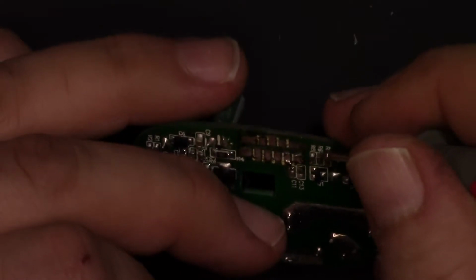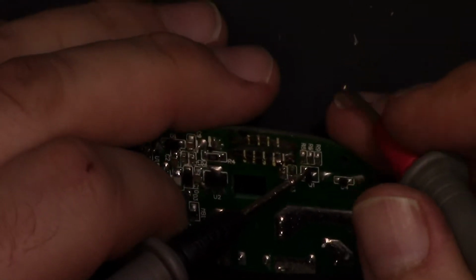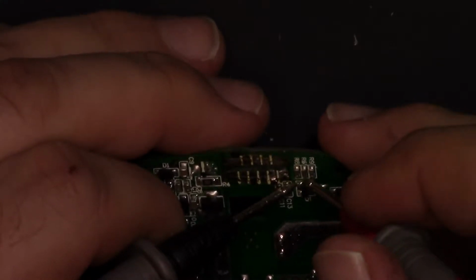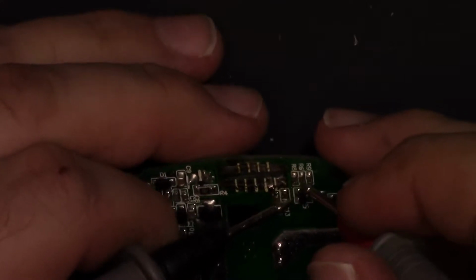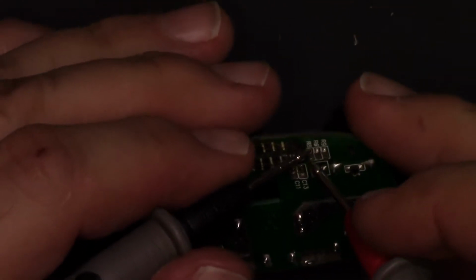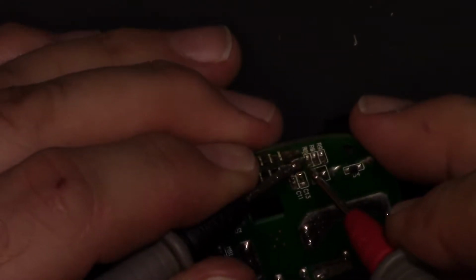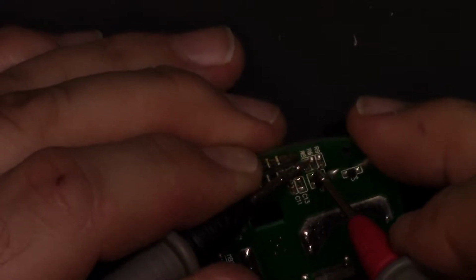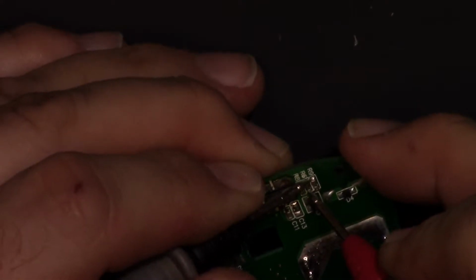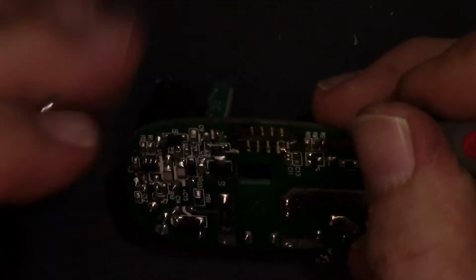Okay, so this must be a split voltage divider to hold the gate low when it's not being used. Yeah, because it's also connected to R6. So R6 and R8 are part of a voltage divider. Let's see, R8, take it out of continuity mode. R8 is 3.3K. R6 is 1K. So 3.3K to ground, 1K. That actually makes more sense for the output.